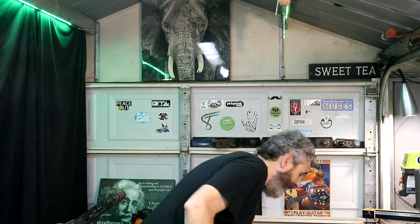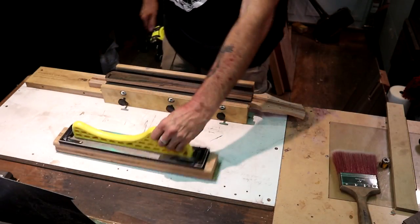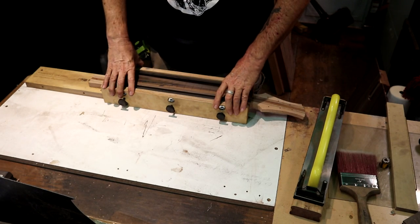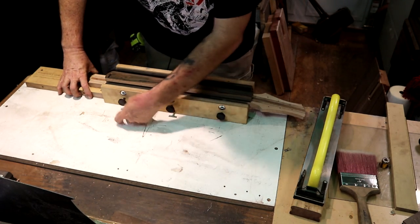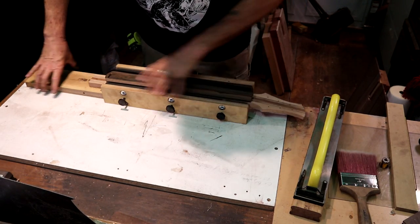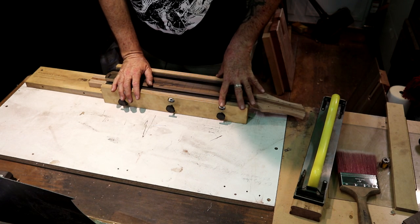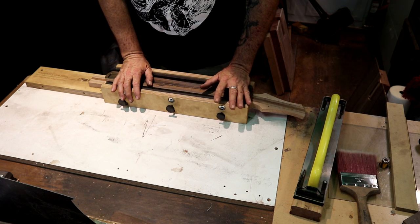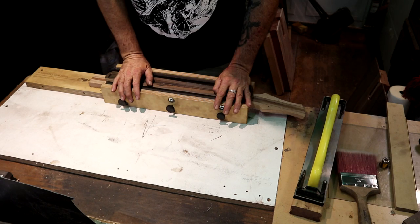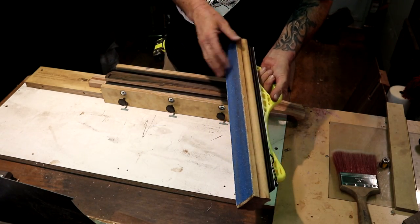What that would cause is I'd probably sand too thin on the outside edges while it's still thick in the middle. I like to cut the radius on the fretboard while the back of the neck still has all the wood on it. I wanted to show you guys something Steve told me about — if you go back and look at the Cloud Nine video, these two sides are actually in the middle of this jig. There are three Allen head bolts that go all the way through the base; you can move the sides fore and aft to accommodate a back-angled headstock. I'm now set up properly with 40 grit 3M Blue sandpaper on my 12 inch radius block.